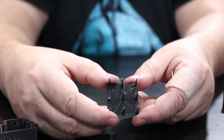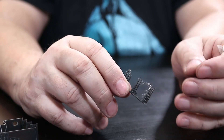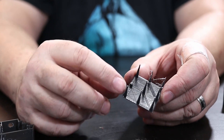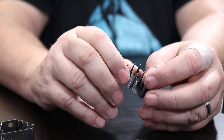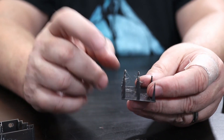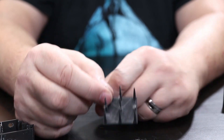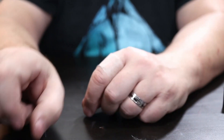This next test — a retraction test — checks for stringing. You can see there's some stringing present, so there are some retraction issues to fix. The points came out pretty good, and the stringing is not horrible, but it's there. Using the LotMax version of Cura, it's not horrible at all, but retraction will need some tuning.